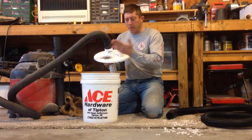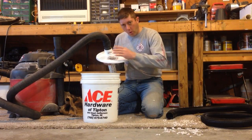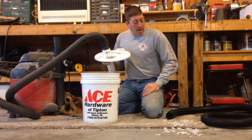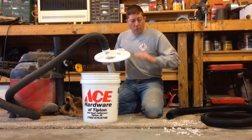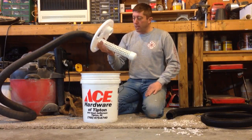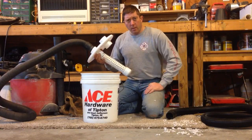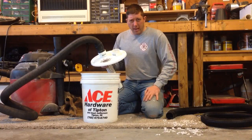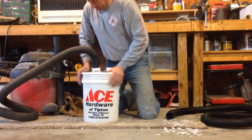And by having this opening with a gloved hand, of course, if I can put my hand over that hole and adjust the vacuum if I need more vacuum pressure. I haven't tried this out yet, so I may need to drill another hole or 2 to adjust that vacuum. We're going to give it a try here in just a minute. I've got everything assembled together. I didn't glue any of my joints. They're all just press fit as tight as I could get them. I don't really see any reason to go to town and glue everything today. So you can see that just snaps down.